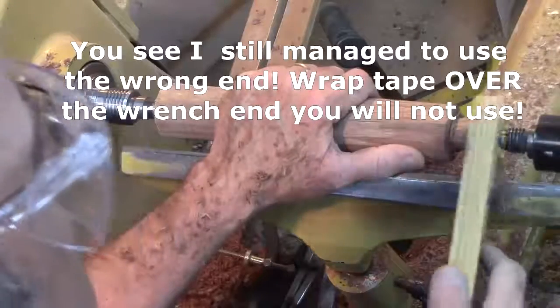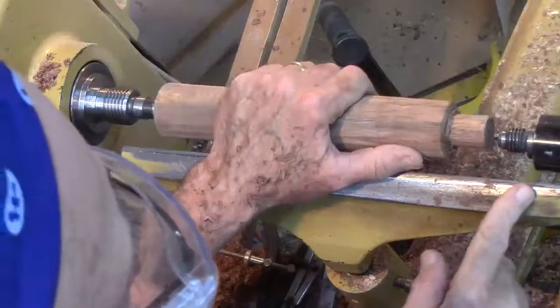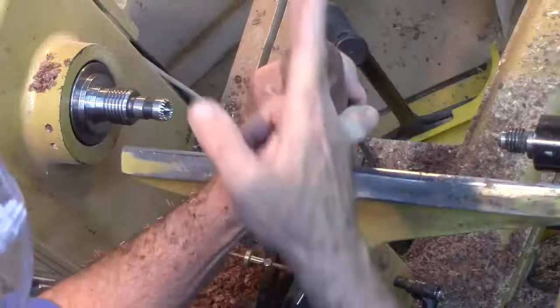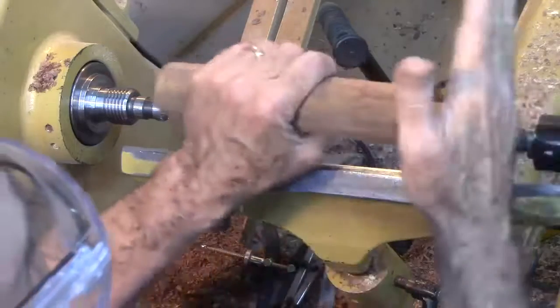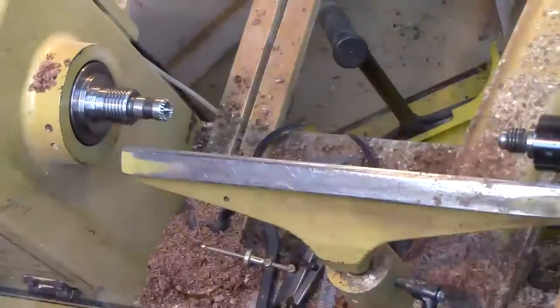If this is too sloppy in the stool, there is a way to solve that problem. We simply take our handsaw. Can you believe I did this deliberately for this teaching point? You take a handsaw and you cut down to here and you put a very thin wedge in it. So when you hammer it in, it'll wedge on there and that'll solve that problem. Let's do the next one. And we're done. We're done sizing that.